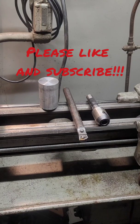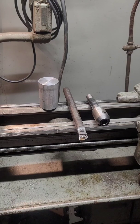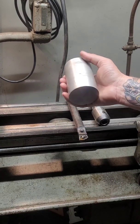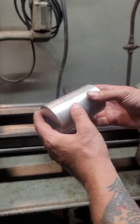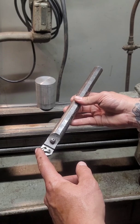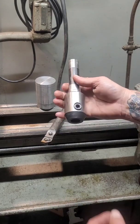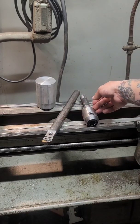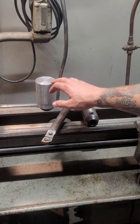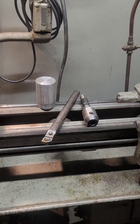Tonight I'm going to start working on making a tool I've been wanting to for a while — a fly cutter. I got a piece of aluminum round stock here; I'd rather use steel but this is what I have to work with. I've also got a boring bar I found secondhand with an indexable cutter and an R8 tool holder, three-quarter inch diameter. It'll be pretty adjustable, which is what I'm looking for — the ones I found were quite expensive.